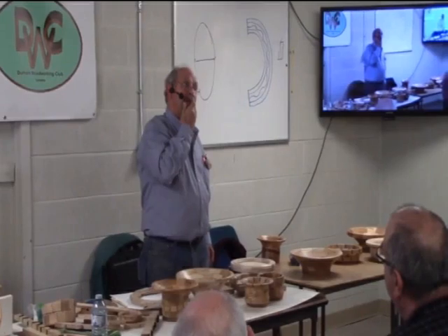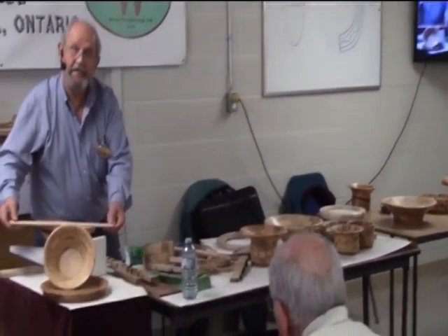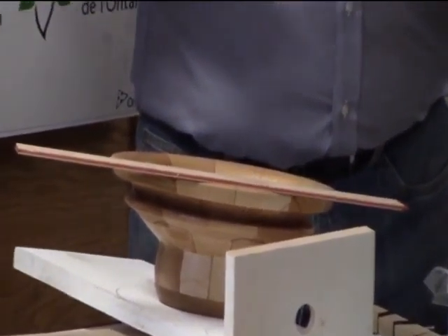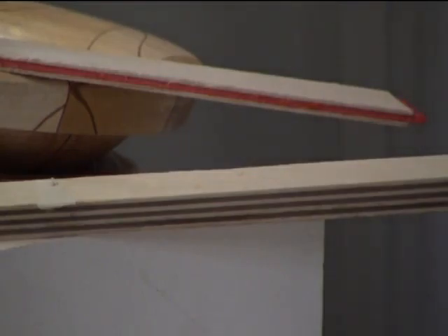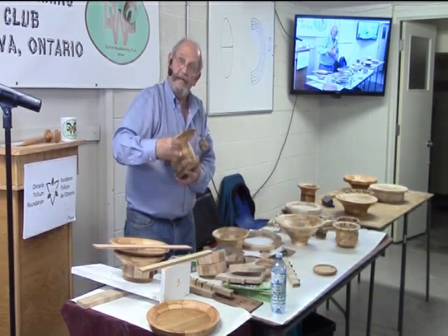Have you ever put two veneers together in one of those parts? Oh, many times. Here is three pieces of one-sixteenth veneer, and here is one, two, three, four — three together, nine pieces of veneer. What I do: I'll make up a piece maybe two or three feet long, glue them up. The glue always oozes out the sides, so I sand one edge and then rip it to the width I need. If you look at these dividers here, that's three pieces — I put it in as a single piece, but it's made up of three pieces of veneer.